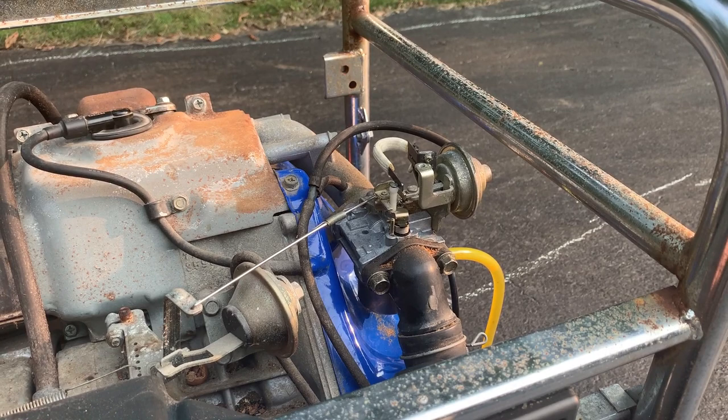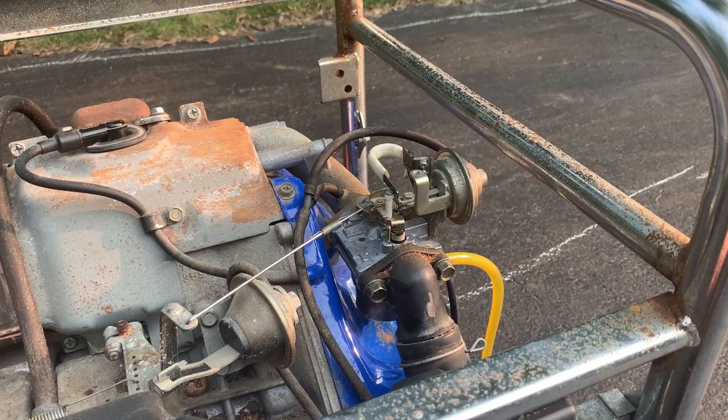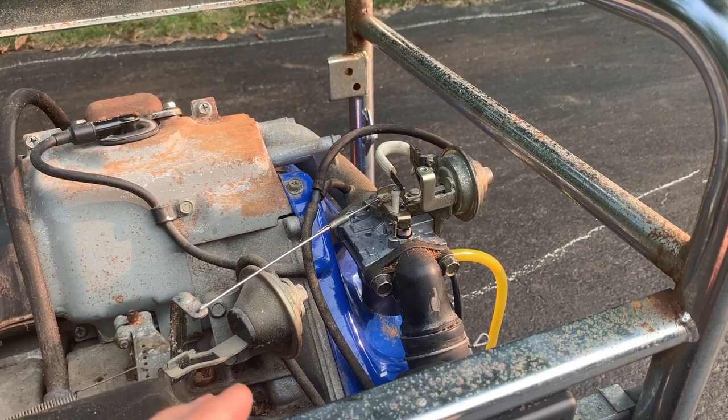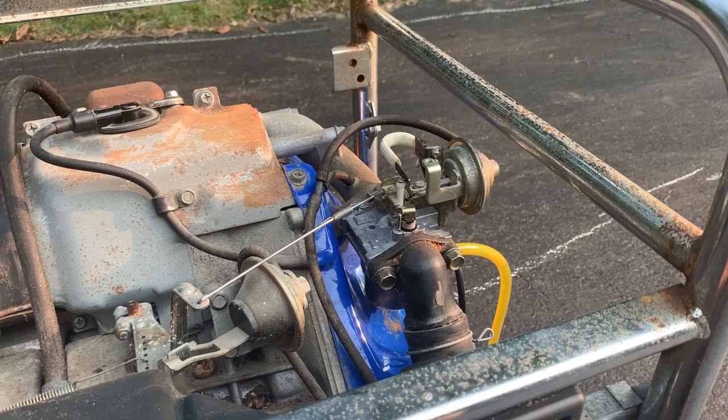Now, it is removable, but I didn't have a screwdriver that could get it out. And it is just a tube. So I took a brush, put it in there, and couldn't get it through. So applied a little more force and then it popped through. A bunch of debris came out. Most likely some sort of an insect nest. So hopefully that's it, because plan B is buying a new carb. That's not going to happen for $300. So let's try this thing out again.